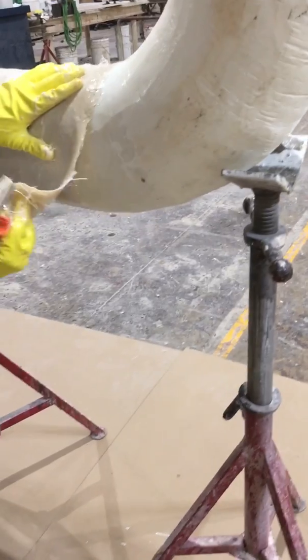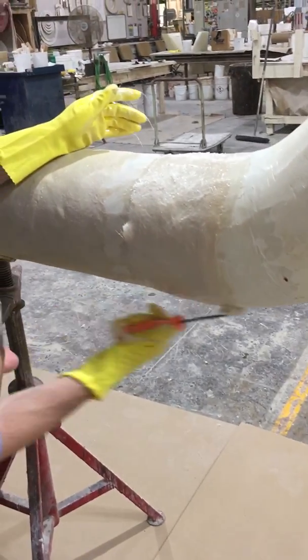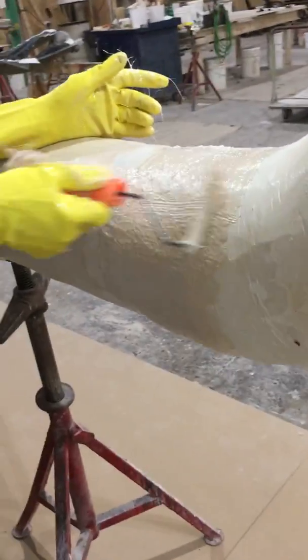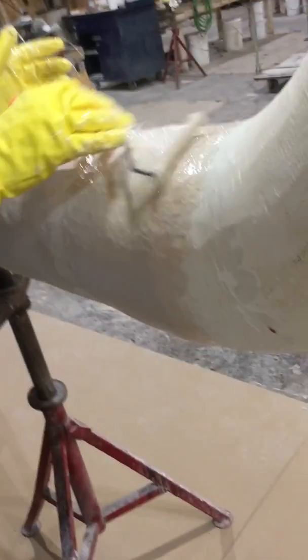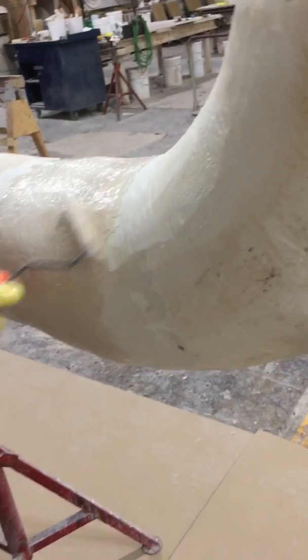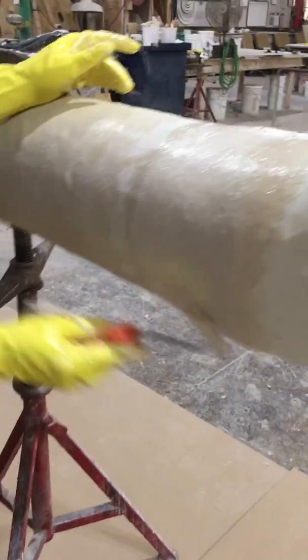As you can see, the glass did not peel off. He's starting at the top on both sides, making sure you overlap all the way. The cure time will be about 20 minutes to become hard and cured, and in a few hours it could be used. The pipe is not moving — the little bit of hot glue put on in three or four spots secures it while he's putting pressure on it to laminate. It's staying secure. We've made another joint and it shows you how simple it is.